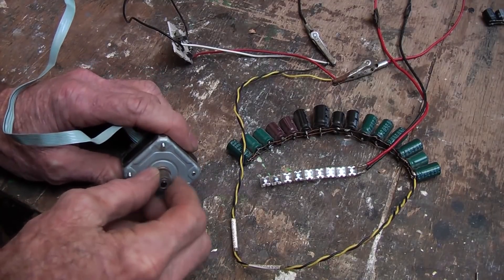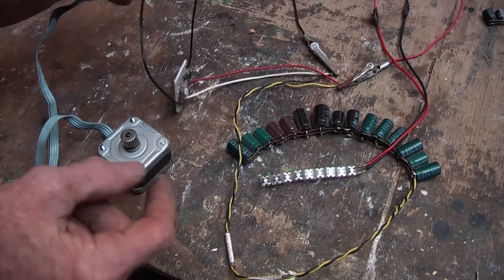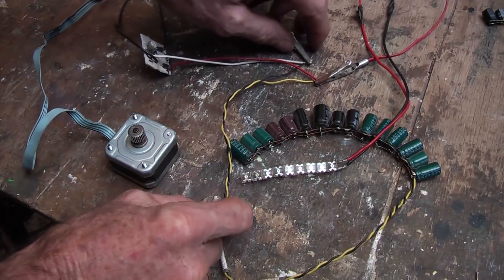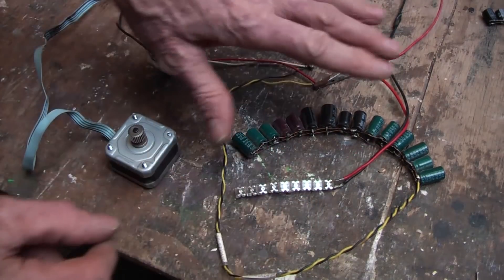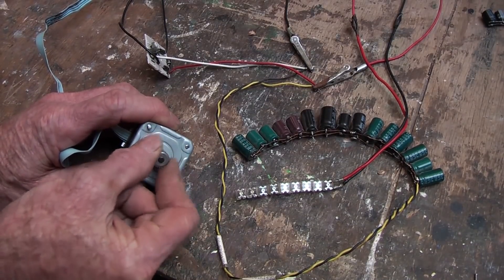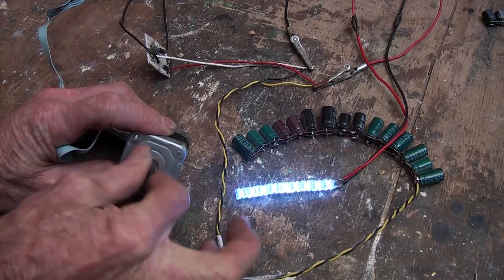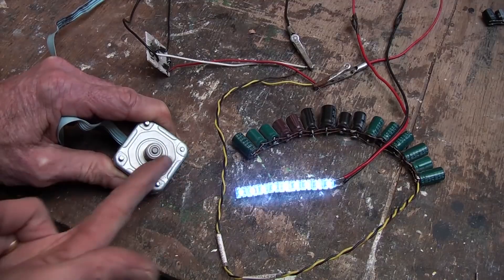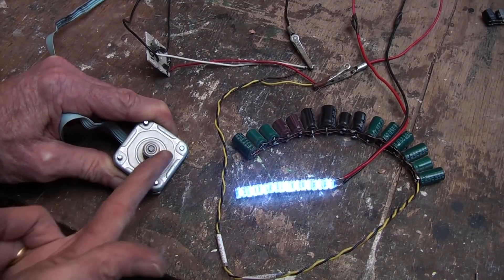Now some of these can be really good, like this printer motor here this size - and they are not too expensive either. It has four wires so it has two circuits. I found the two positive and negative. It comes out as AC, so I want to run it through a bridge rectifier so that I can make sure I have a positive and negative DC running into a capacitor bank - electrolytic capacitors, so they have to have a positive and a negative - to even out the current a little bit, and running the 9 or 10 LEDs. Now look at this - if I just do this a little bit. Look at that! Just turning it with my fingers, about a quarter of a turn back and forth gives me quite a bit of light, and considering this is only half of what this motor is able to produce because it has got two circuits. So with a bridge rectifier on each circuit you can join the two together and get twice the amount of power. So you can bet I will be experimenting more with these ones in the future.